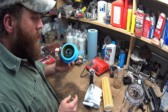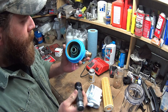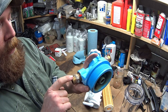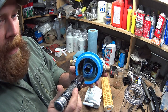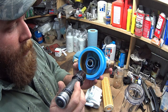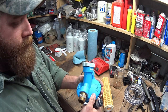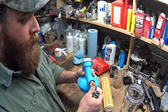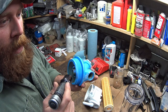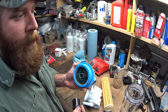I installed this one but we had a problem with it. What you need to look for is make sure that the hole here in the middle goes all the way through straight through, and then connects to one of these ports without any kind of obstruction. What was in here — and I've actually taken a drill and drilled this out — was a little perforated section, and what was happening is on the inlet side it was allowing that lime scale to pack up in there and shut it off. This stuff will not dissolve unless you run CLR or straight vinegar through your lines, and even then it takes some time to actually break it down.